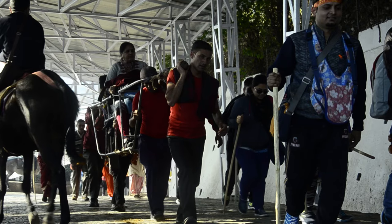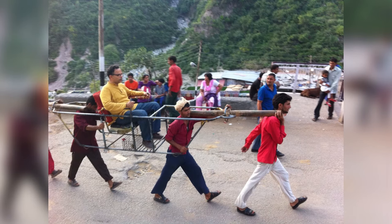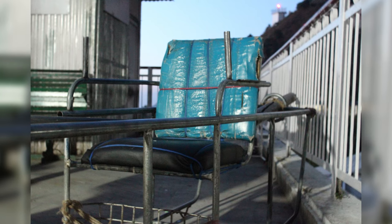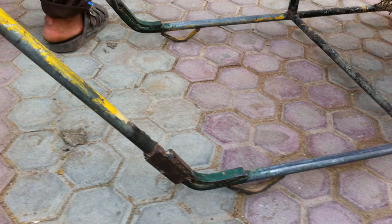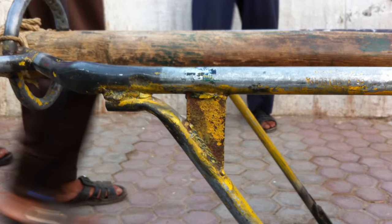We took the cause — they said come on, we'll design a palki which is lighter for the porters. But the context is very, very challenging. How can you do something worthwhile for these people? We observed the palki very closely and found that this is grassroot innovation. They pick up whatever local material is available. What is available locally is water pipes — GI water pipes, galvanized iron — and those pipes are very heavy. They weld them together, and from metallurgy we know that when you weld galvanized iron pipes together, the welding is not very strong. Due to constant loading and cyclic loading, there is cracking in the welded joints, and it is also very, very heavy.